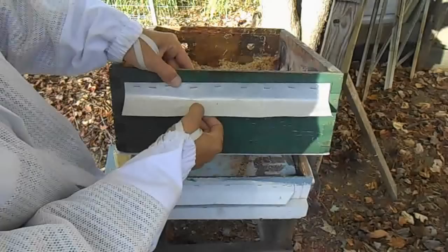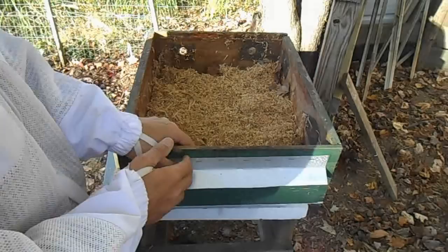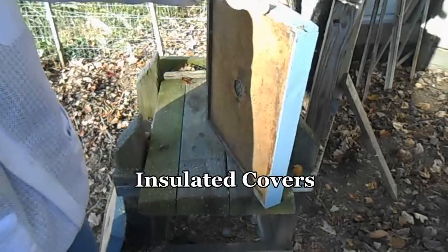The reason for the upward angle is that any rainwater won't be able to run in — it would run out. To further help protect against rainwater getting in, I've taken drip edge or metal flashing and stapled it over the holes, which you can see there. That's probably not necessary, just an extra precaution. This is one way to keep condensation to a minimum.